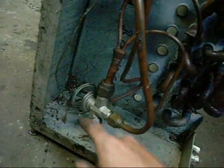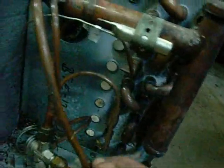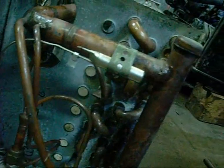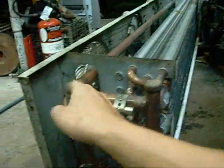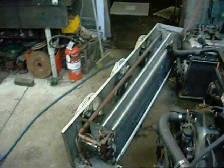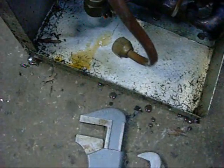It's always worth a try before you scrap it. It's got a really old Danfoss TXV on it. I'll just undo that, cut all these lines off and try and open up these crimped ends - that's going to be the key. Opening it up, soldering a new manifold like that onto here, so you've got one big input, one big output. Pretty straightforward - just delete all that, solder these shut, and that'll be it. I think I'm going to have to run a litre of gasoline or something through this because that oil smells horrible.